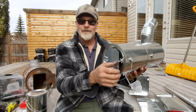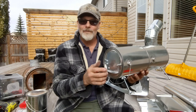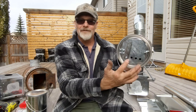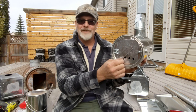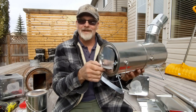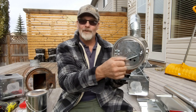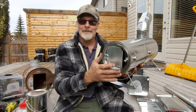Basically a quick quarter turn there and that door stays closed. The other thing that was a concern to a lot of you was air vents in the front. So I drilled three holes there and cut a little bit of material that happened to be bent into an L shape, so it gives me a little bit of a handle. With one bolt I can go up and down with the air holes and regulate the amount of air going in.